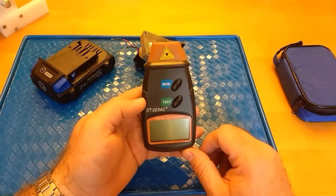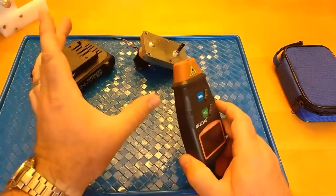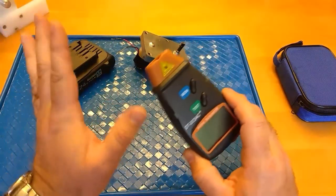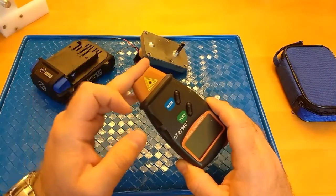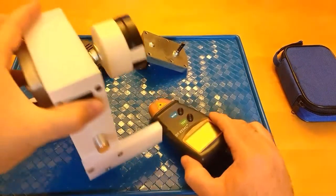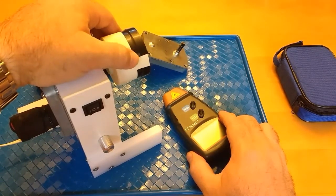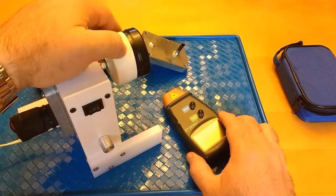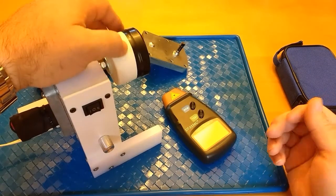It's pretty reliable. I think you get really accurate measurements with it. The diameter of your shaft, or whatever you're measuring the rotational speed of, none of that matters. All it's doing is counting how many times light's reflected back into it per revolution. Now, on this one that I was demonstrating earlier, if I'd left 2 open spots on it and turned it down to a lower RPM range, I'd need to make sure to divide my result in half.